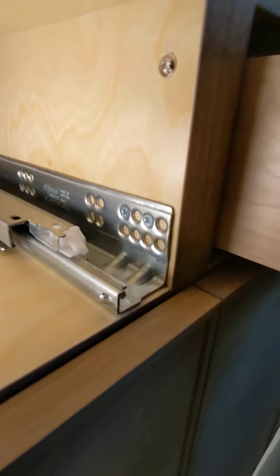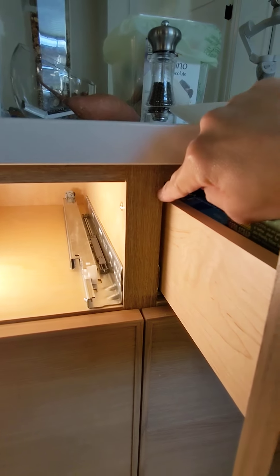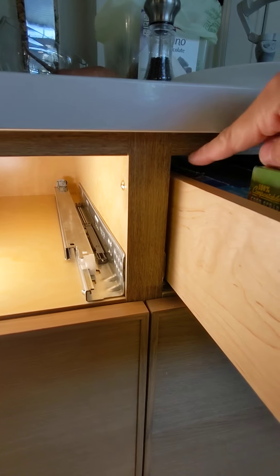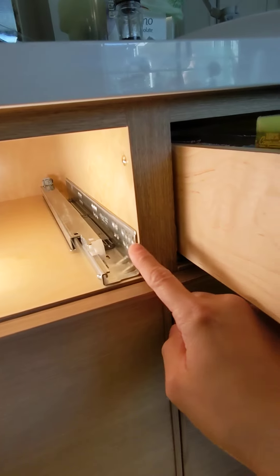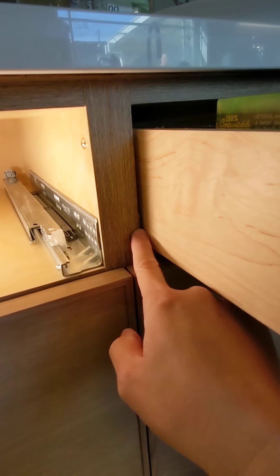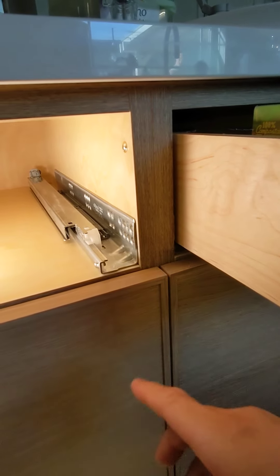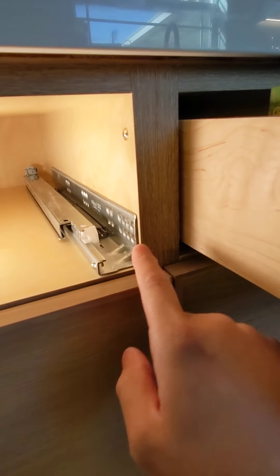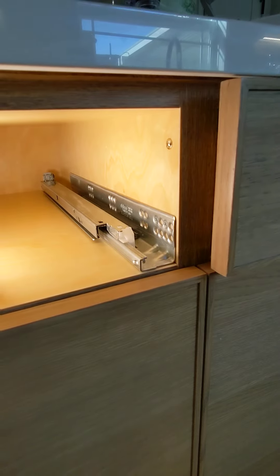The only other thing to watch out for is if it's a screw that's too long, it's going to poke through, and obviously you don't want that. In my case here, I have two side panels — the side panel from the original cabinet on the left, and a side panel on the right-hand side. If it's an unfinished place and a screw is a little longer and pokes through, that's okay. However, if it's an exposed side — like the edge of the run or the last cabinet in your island — you want to make sure the screw is short enough so it does not puncture through all the way.